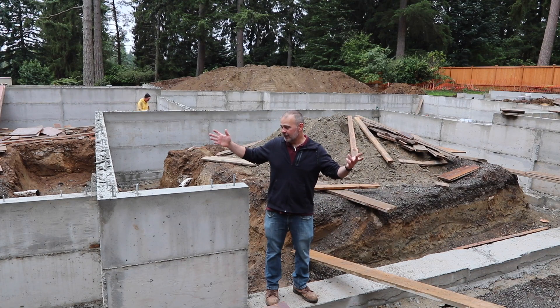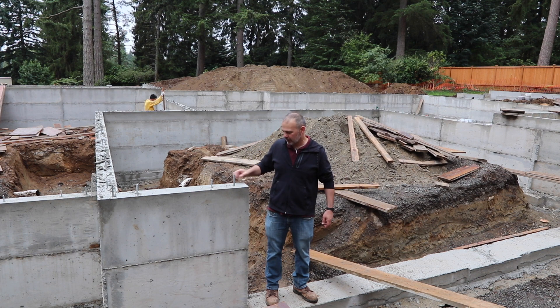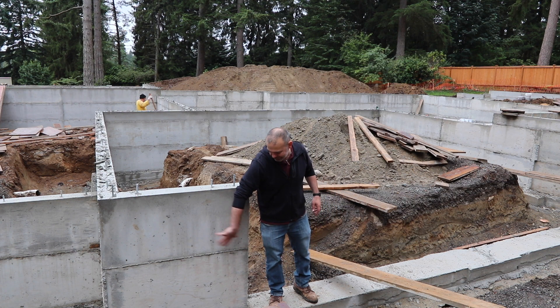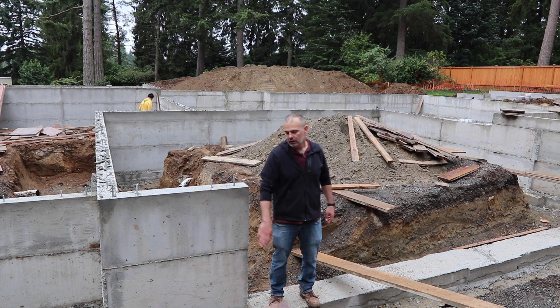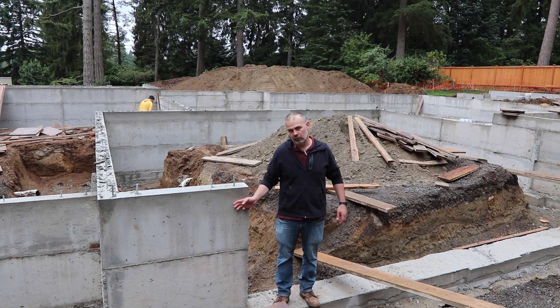So that's it. They did a great job. We just need to finish scraping off the edges here. I knocked the pins out earlier. And then I got the waterproofers coming tomorrow — they're going to put like a bituminous, sort of tar-type spray to cover that cold joint between the bottom of this wall and my footing.